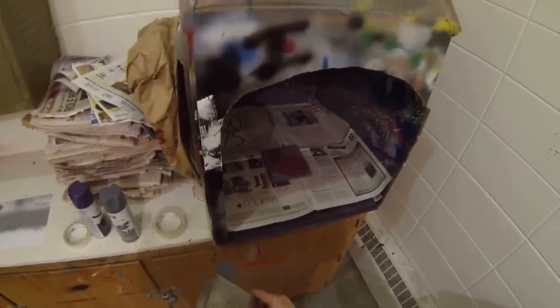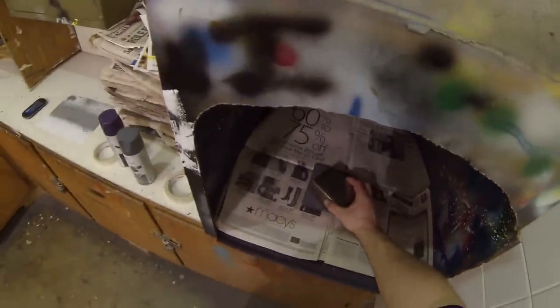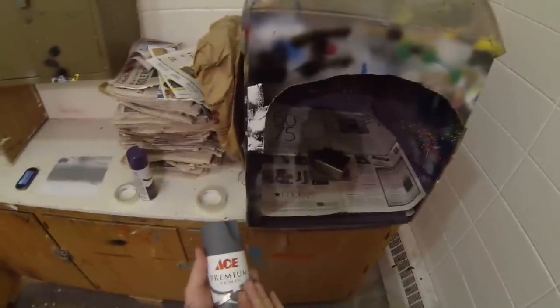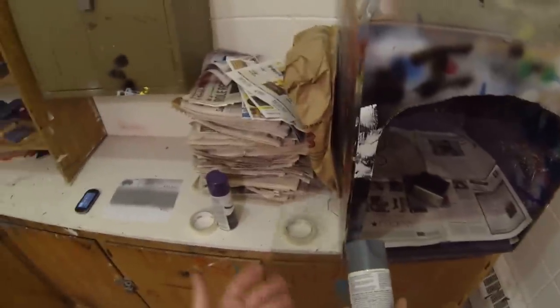Take the back of your sheet metal box and leave it up — finish the bottom first, then flip it right side up, put some finish on the inside, and then set it in the drying rack. The first product I'm going to use today is primer. This spray can of primer adheres to bare metal and has additives that make it a more durable bonding agent. You may need to read the product directions for dry time — I estimate about a ten-minute dry window between coats.